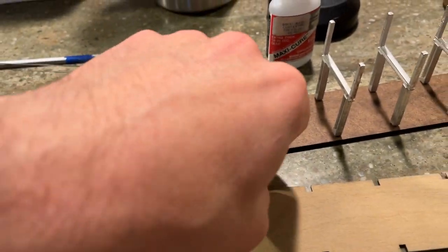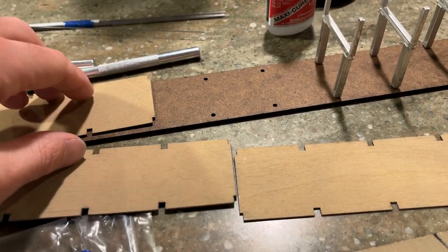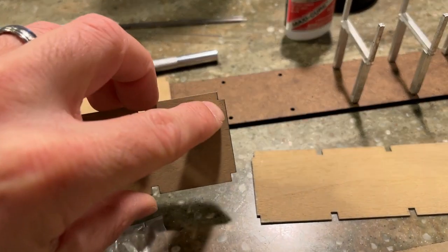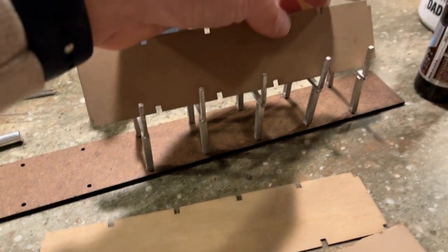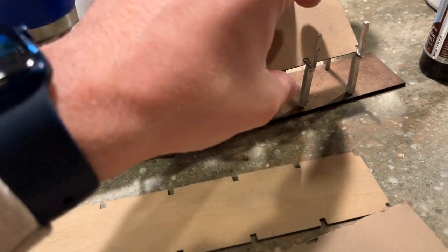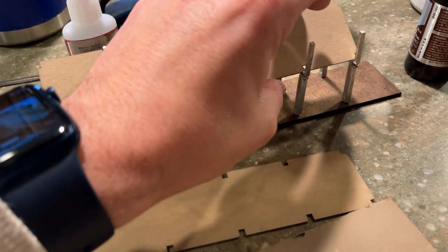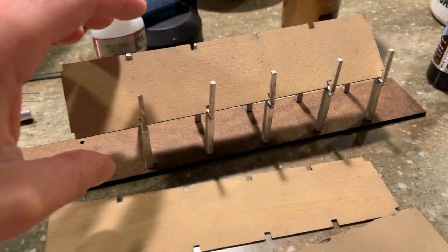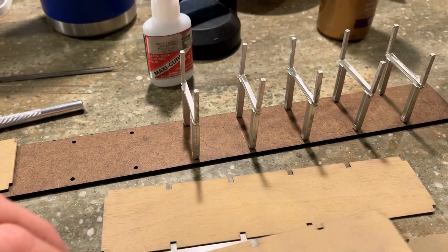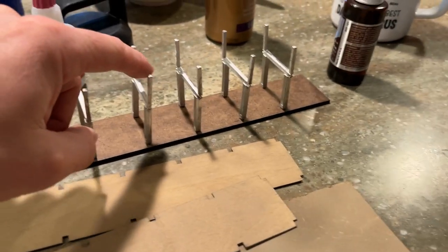These pieces here — you'll see that little square cut on the end is a half cut, and that's a half cut there. If we flip it over, that's a full cut square. So what we're going to do is that's going to go on the end like this, and we're going to kind of angle that in — I'm doing this one-handed — and then this will slide down into place.